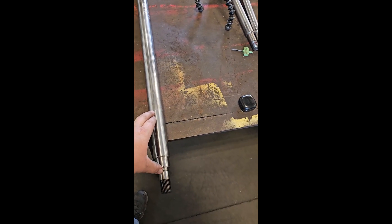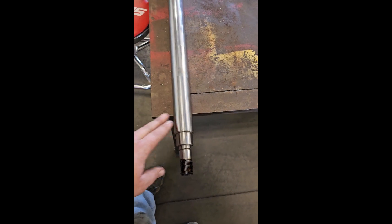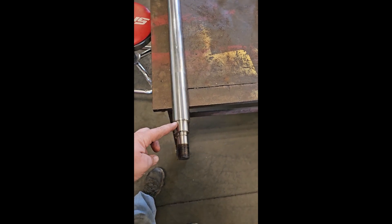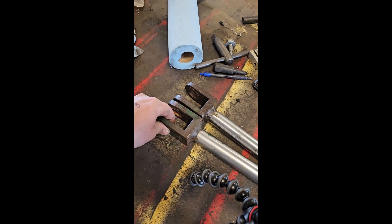There's also some scuffing here. You can see this is a common wear spot and then it stops. This shaft probably spends most of its time up at the top, so there's a lot of wear going on here but not so much here because this part stays inside the cylinder. One of the processes I do is I've got lots of bar stock of this and I just cut all of this new. When it's a common one like this, I've got a lot of these in stock.